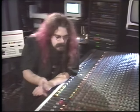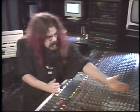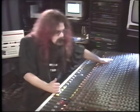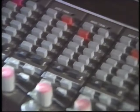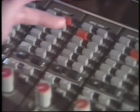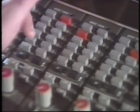If you've never used a mixing desk before, don't be put off by all these knobs and switches. Because apart from the middle section of the desk, all these sound modules are duplicated all the way along the desk — so if you can learn to use one, you know the whole lot. At the top you usually find the routing switches, one to 24 on this desk. This enables you to send whatever sound is patched into this fader to any one of 24 tracks on the tape machine, or transfer across to another fader or subgroup on the desk.